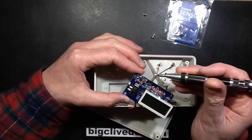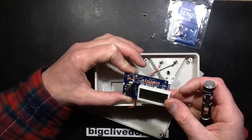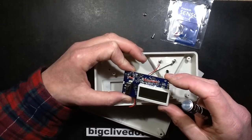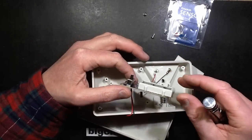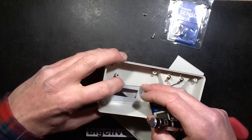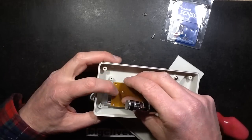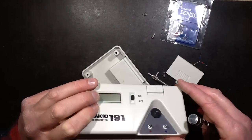It's got what looks like a little voltage regulator for stability. I know there's going to be a chip under this — the typical thermocouple or meter type chip. There are a few surface mount components for the amplification of the thermocouple, and that's about it. I don't want to take the LCD off because, as anybody who has taken LCD displays apart with zebra strips knows, sometimes they don't really work well once you put them back together. The display panel has just been stuck in randomly at a funny angle, but yeah — there's not an awful lot to it, which I kind of didn't expect. The real work is being done by this thermocouple here and the tensioning system. But yeah, it's a useful tool.